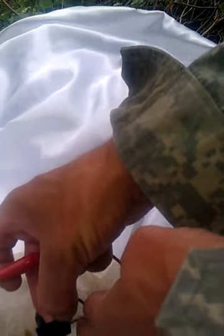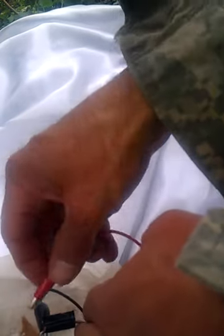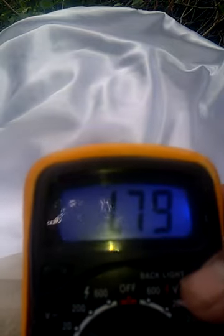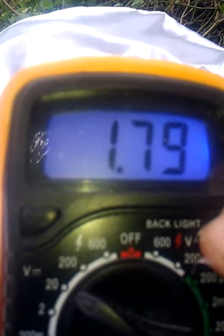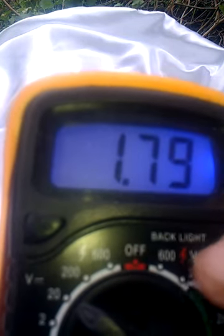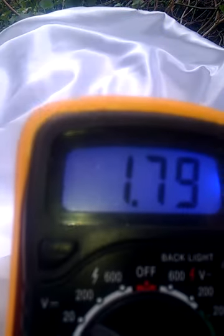Alright, let's go ahead and hook up the other one. You guys can see that — we're at 1.79 volts. I really haven't even activated the battery yet by shorting it out like I should, but it's easily drawing 1.79 volts. As you can see we're on a 20-volt scale, so that's a comfortable almost 1.80, compared to 1.61 when it was freshly made.